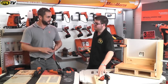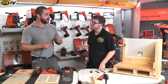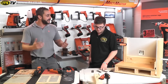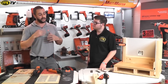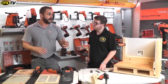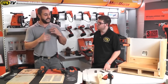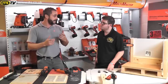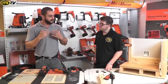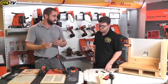Does that mean these blades aren't going to be able to cut screws at all? It depends on the makeup of the screw. If we just took a bog standard screw made from the same material as a standard nail, then absolutely fine — the machine will cut through it. What we're coming up against a lot is that these screws are actually from a collated strip of drywall screws, which are hardened. A lot of nail guns use hardened nails, and when you come across that sort of material, the oscillating tool at the speed it runs at — as we've seen — generates enough heat trying to get through it that it will just dull the edge off the blade.